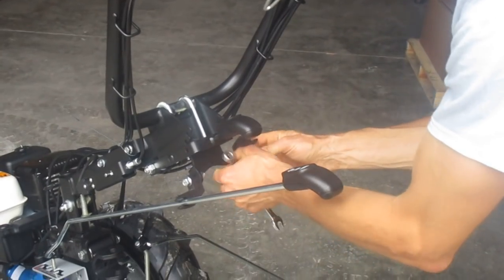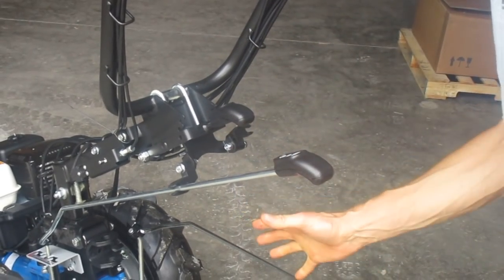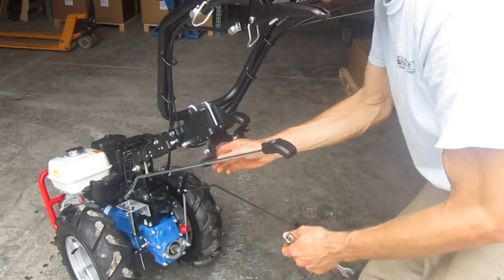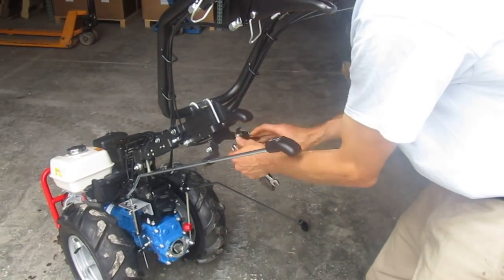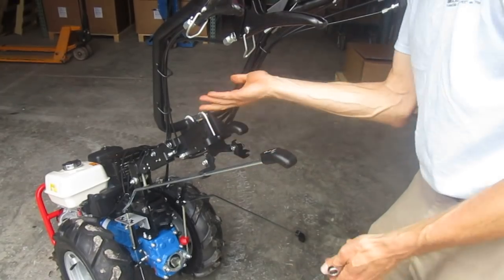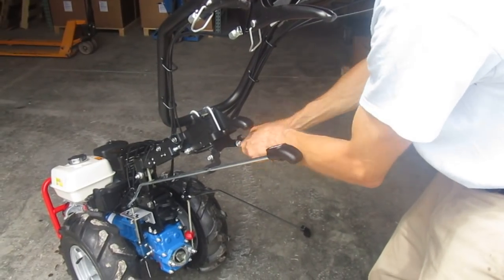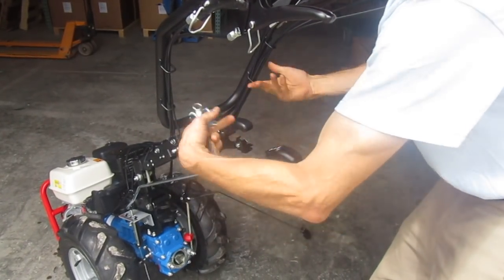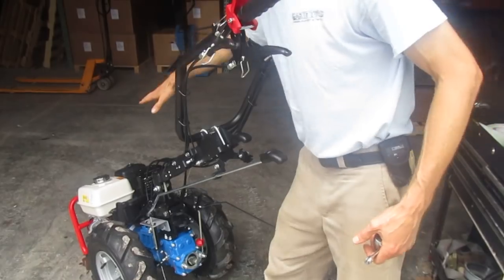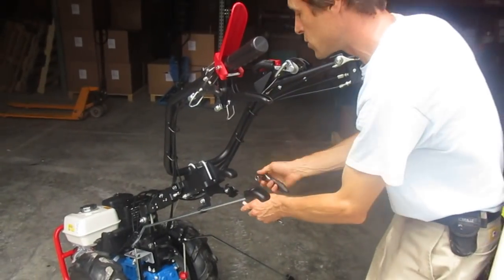The one time this may be an issue is if you have some implements that stand up real tall in here, like a swivel rotary plow or the swivel moldboard plow. They might get tall enough under here that these things actually hit the hood of the implement, or in the case of a moldboard plow, it might come up and hit them when you flip the thing over — in that case, you'll just have to flip them back to their upright position. Also, on the electric start tractors we can't do this; we have to leave them in the factory position because by dropping them down, when you turn the handlebars around, the battery which sits right here actually contacts the shift levers.